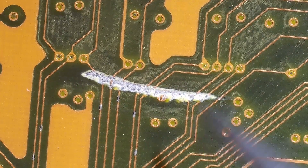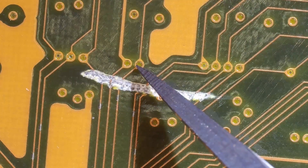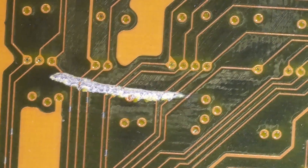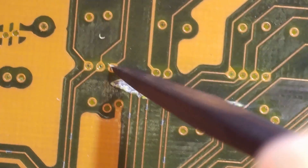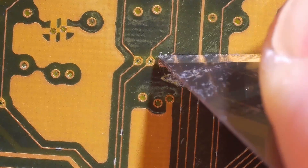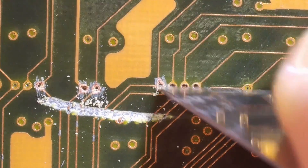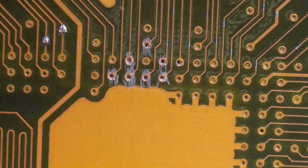Because of the wide gouge and the very thin traces, I don't think I'm going to try to do bare wire bridging. All of these traces have easily accessible vias on either side of the cut, so it probably makes more sense to just do some bodge wiring here instead. It won't look that pretty, but at least it'll remain hidden under the board, and I think there's a pretty decent chance I can get this thing going again. So the first thing I'm going to do is try to get the solder mask out of the vias — I'm just gently drilling them out with a sharp poker tool here. It turned out to be a lot more annoying than I thought, but with some patience I got most of it out. Next I started gently scraping off the solder mask around the vias on either side of the damage to expose as much copper as possible. The microscope makes it easy to see when you've got enough off.